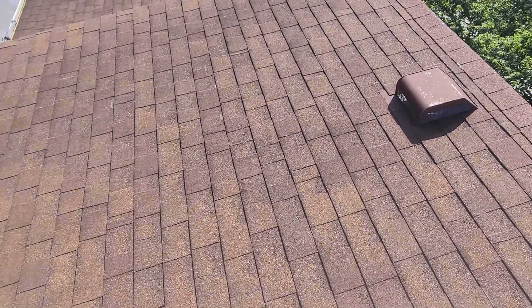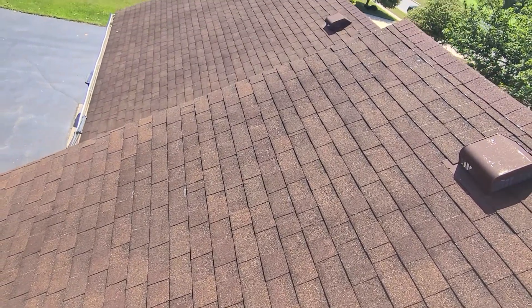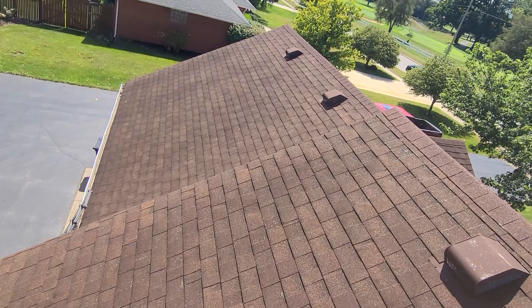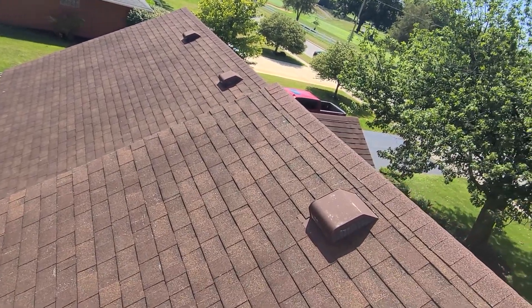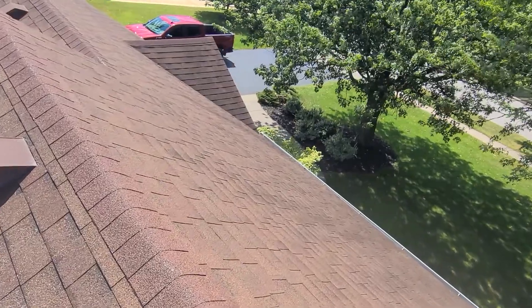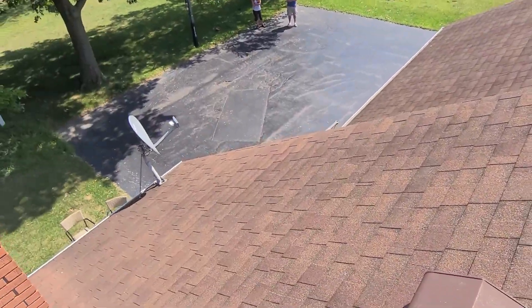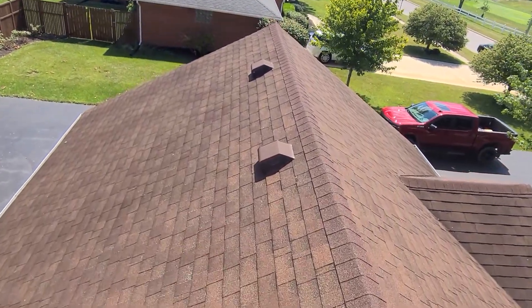Just look at the entire backside of this roof. In areas my phone's illustrating all the white substance you can kind of see through there — that's the fiberglass mat. That means the shingle is starting to fail, or it's in a state of failure right now. So basically I'm going to recommend a full replacement. I'm going to start pulling some measurements, probably get an eagle view drawn on this thing, and then I'll give you my full assessment.